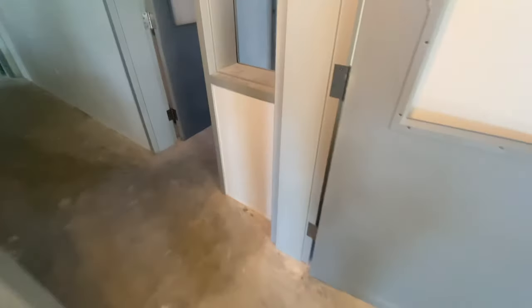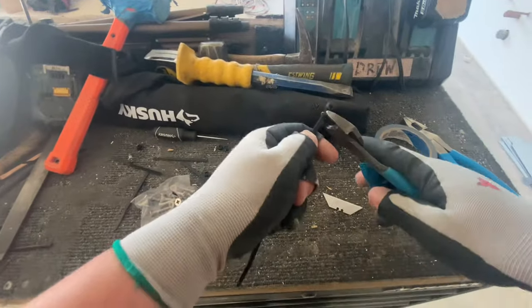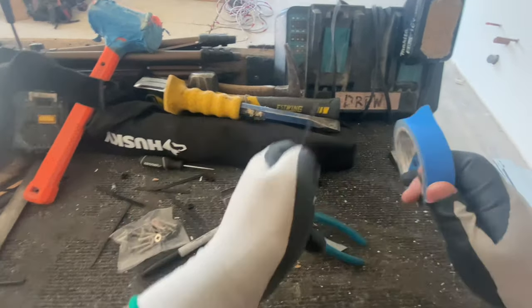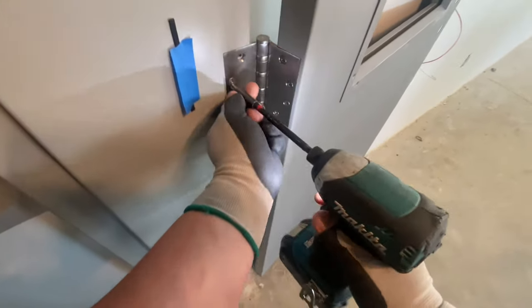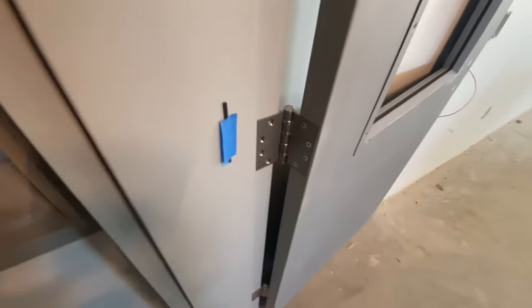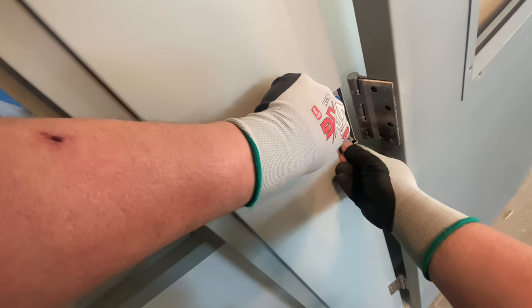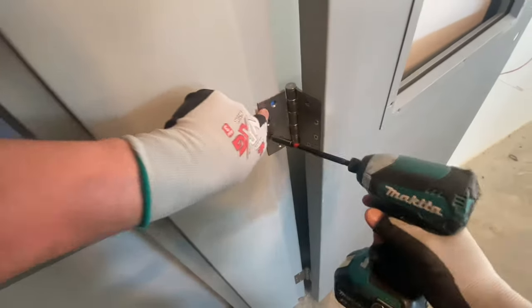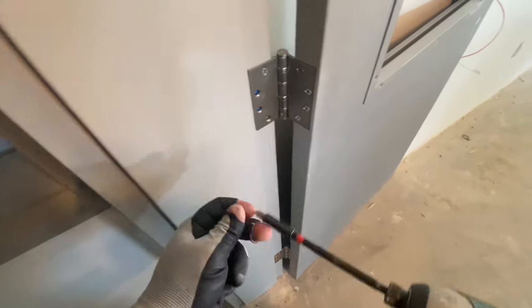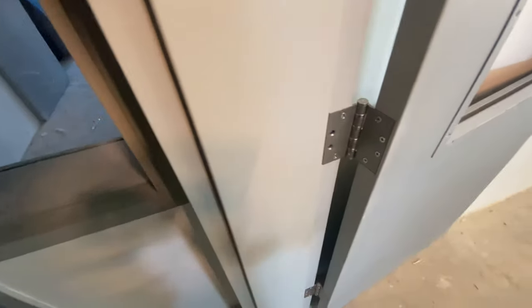Looking at it, I'm thinking if I put a shim behind that middle hinge, everything would get even just a little bit better. I'm going to shim that middle hinge back as well — that's going to make this opening look as good as I can get it. This is a really large welded frame. All I care about is making sure that door portion looks really good. So I'll put one more shim here in the middle of the middle hinge, tighten the outer screws first to pull it back. Remember, this is a non-rated frame, non-rated wall, non-rated door.